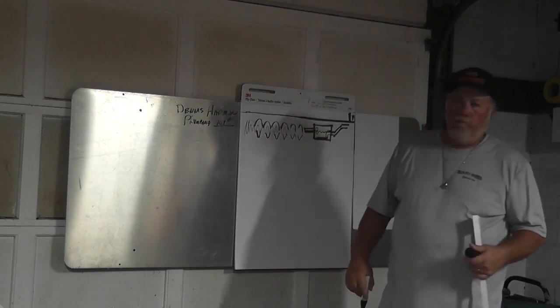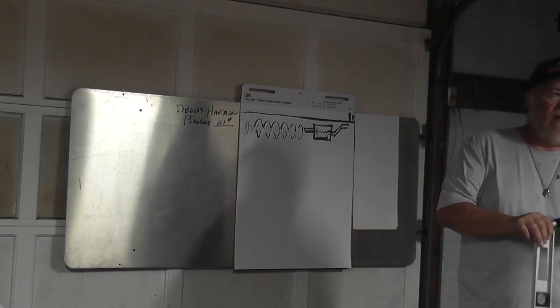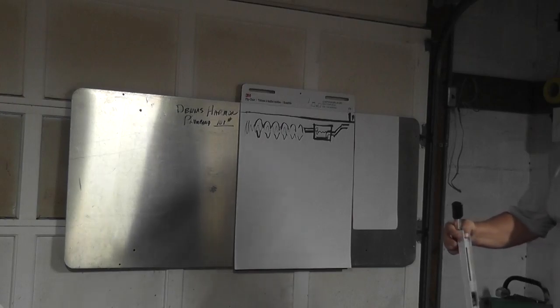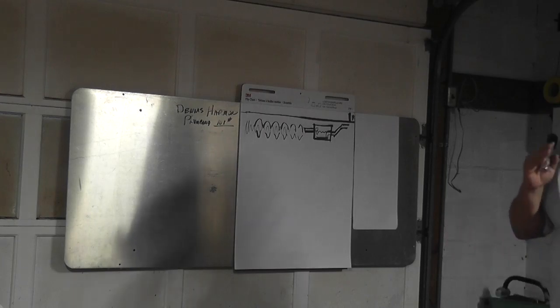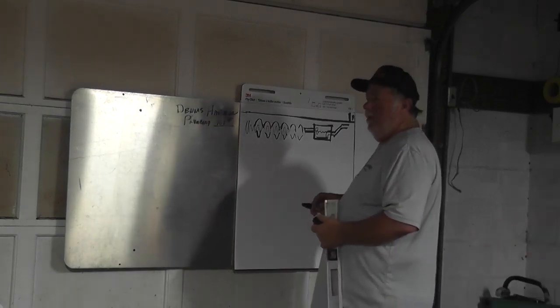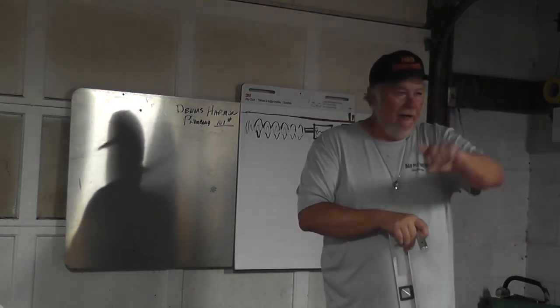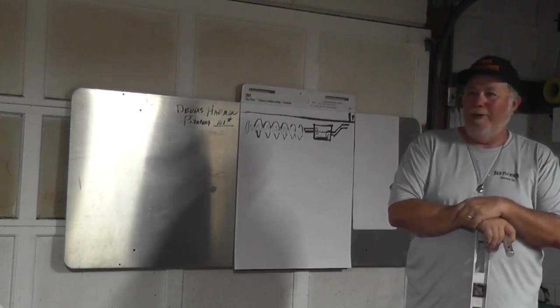This liquid eventually filters out into the drain field — it's anywhere between 400 and 800 square feet. There are different drain field materials; we use what they call EasyFlow. It's a styrofoam in a big wrapper that looks like a net. You lay it in rows, it has tubes going through it, water passes through it and filters out into the styrofoam. When you drive down the road during a drought, you ever notice people's front yard has that green patch of grass turning out to brown? That's the drain field.